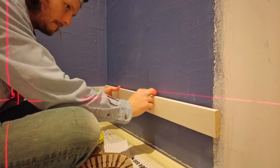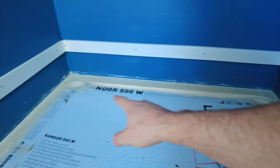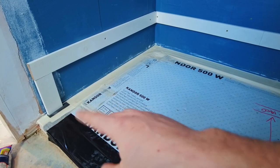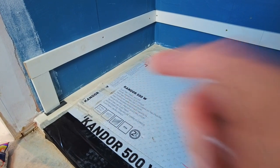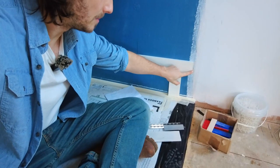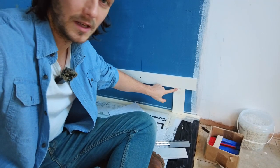The reason why we're doing this is because we can't rely on a tray. This is bang on level, this is bang on level, and then this, it's come up maybe a millimeter or so. That's basically the tray is slightly warped. It wasn't me. I screwed them directly into the stud work, and that way you're not going to get any bending. It depends how stiff your wood is basically. At the end, the batten's over here, but you need to leave a gap for your tile trim. So I've just propped it up at the end, that way this bit won't sag.